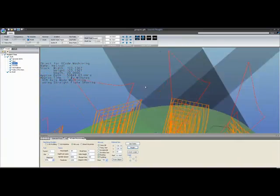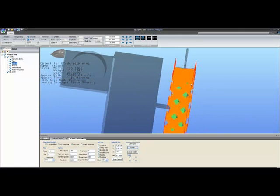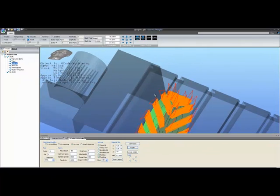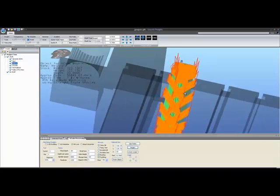And you can see, though, by looking at the toolpath from various sides, we are actually going quite a bit to one side of the gear, starting to sweep across to the other side of the gear, and we leave ourselves a fair amount of clearance on both sides. That clearance is set by a drop-down box beneath routing and toothing called clearance, and you can select up to 100% of your tool bit to step off to one side or the other.